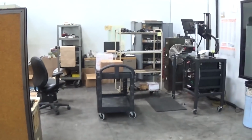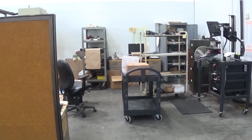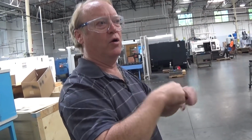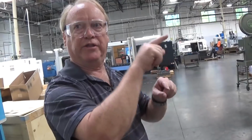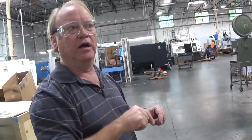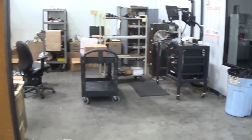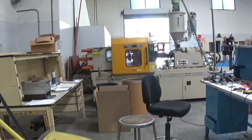Yeah, go ahead and feel free. This is our laser department. Everything will come back through here. Just about everything we produce gets some sort of laser mark on it. It might be a graduated scale on the leading edge of a table or cross slide, or the radial hand wheels get their markings. Chucks will get different marks. It might be our logo, something like that.